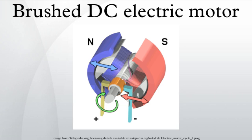Environmental conditions, such as dust, explosive vapors, water, and high ambient temperatures, can adversely affect the operation of a DC motor. To protect a motor from these environmental conditions, the National Electrical Manufacturers Association and the International Electrotechnical Commission have standardized motor enclosure designs based upon the environmental protection they provide from contaminants.